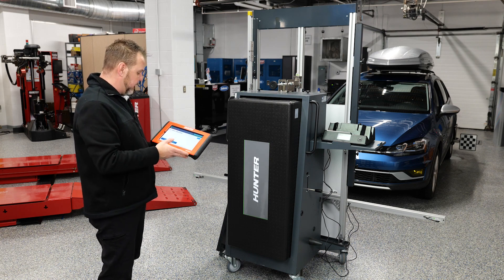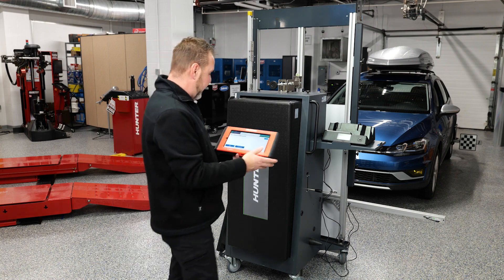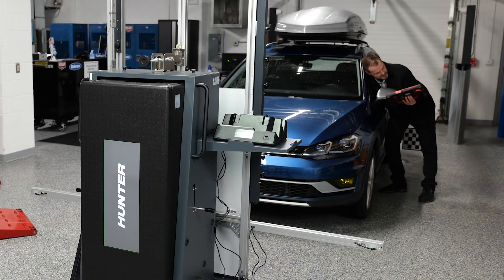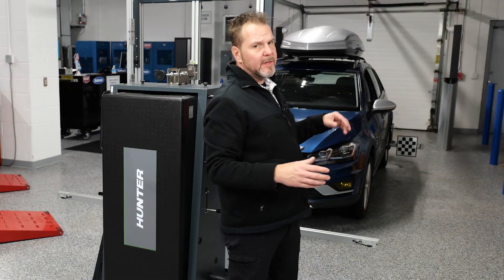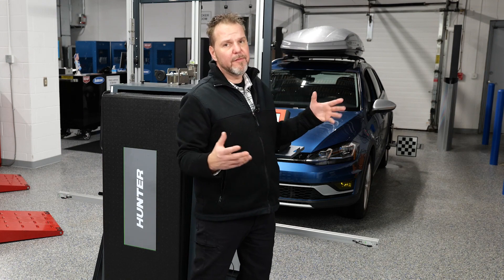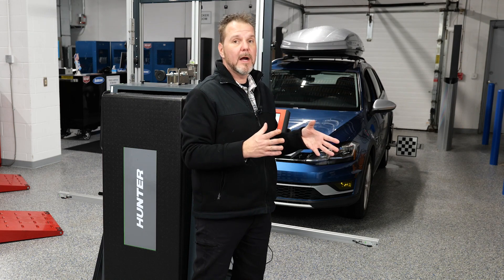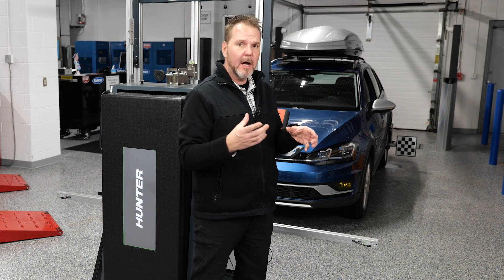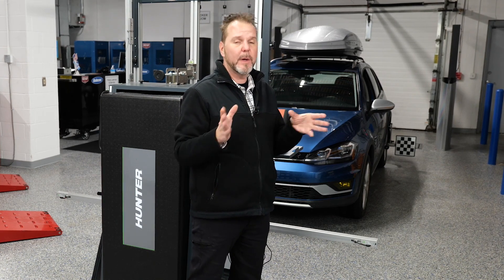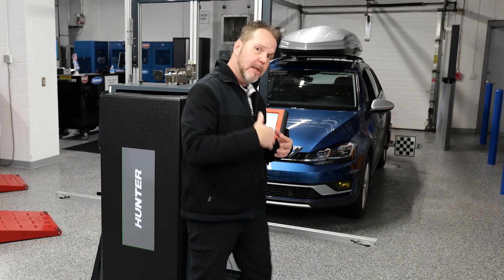It's asking us to turn the ignition off, so I'm going to do that. Next, now that I know we've got a failed concern with the actual front radar, let's go ahead and take a look at that front radar sensor and see if everything looks okay. We're going to head to the front of the vehicle, take off that Volkswagen emblem — there's a little special technique to show you how to do that — and look at the condition of it before we dive any further.